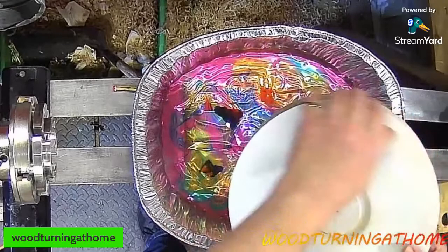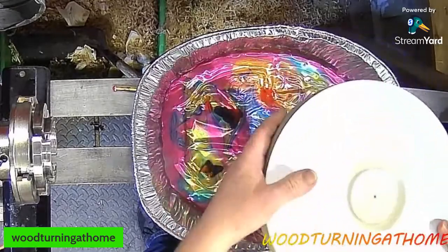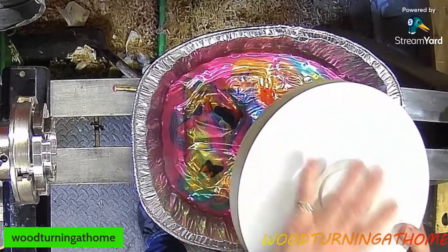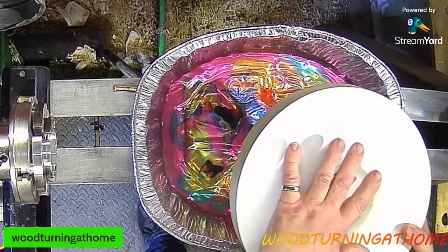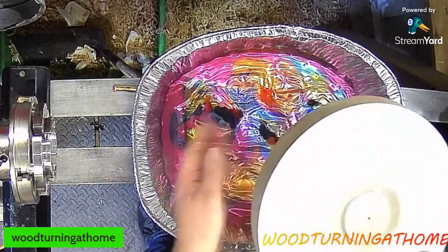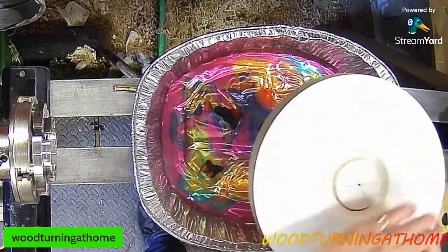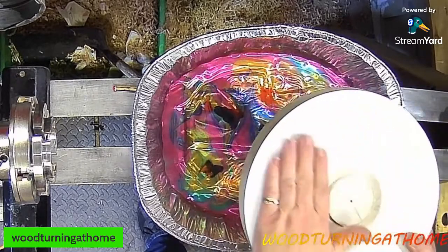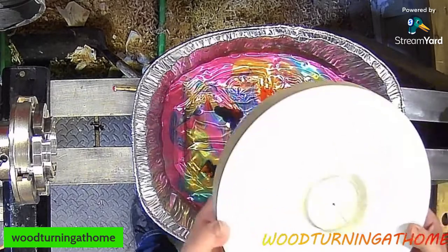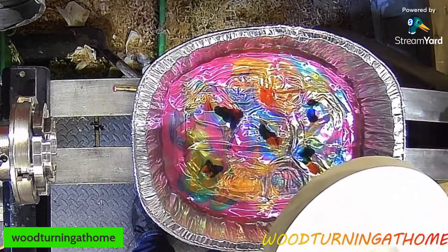So instead of me doing that, I just seal the edges right around with sanding sealer and give it a wee light sand, because the sanding sealer makes it a wee bit smooth and the paint won't stick to it. That happened to me. And what I had to do is dry it all off and rough it down with a sandpaper, and then do it again, and it worked okay. What grit did you use? 240.